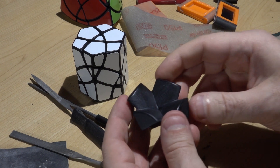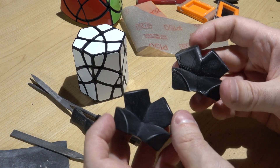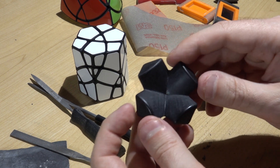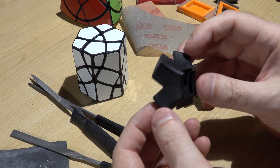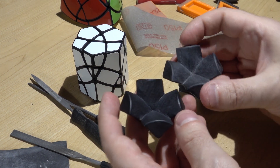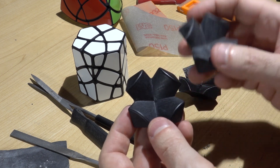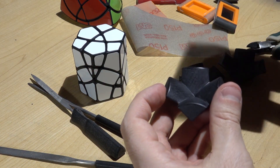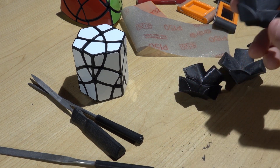Here's a piece that's finished, compared to a freshly printed piece — you can see the lines in the fresh one and they're pretty much gone in the finished one. Some that show up in the camera aren't very visible to my eye — the camera and lighting pick up a little extra. Here's one that's just been filed but not yet sanded, and you can notice that once you sand everything gets a little bit gray. But as you go up through the grits to 1000, finer and finer, it gets darker and starts returning to black.